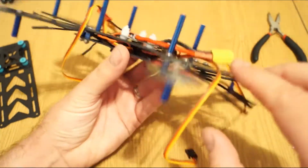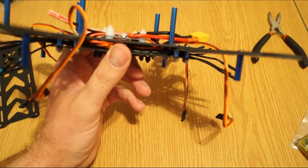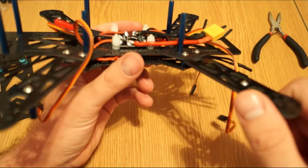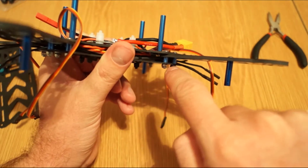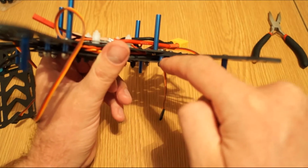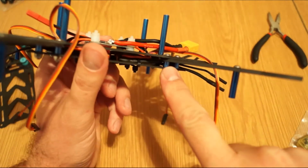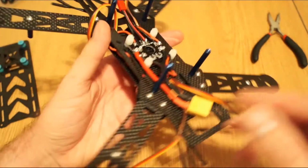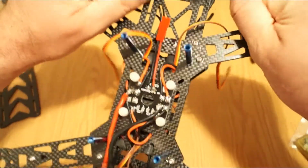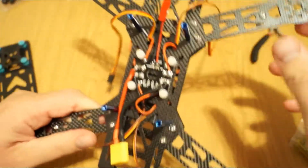One mistake I made, because usually I don't read manuals, I only read the manual when I have issues: be careful how you put the spacers. By putting them wrong, like I did, I put the top plate, then the spacer, and then I put the arms below. This is wrong, because then the frame will flex too much. This is the order that is shown in the manual and the order it should be. So now the quad is stiffer, and we'll have to see how it performs.